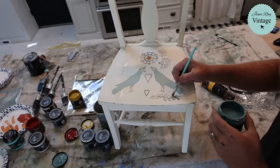To get a more durable finish, you do have to have some chemicals in it. So that's why it's not completely no VOC. So keep that in mind. I would say Big Top would also be fine. We've used that, and we've also used Sweet Pickens Old Finish that used to be all natural before they came out with Final Finishes. But the new Final Finish Sweet Pickens top coat that we carry is rock hard, and you can get it all the way up to a gloss finish. So a little bit more customization, because you can get matte, satin, or gloss in that.